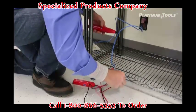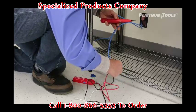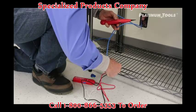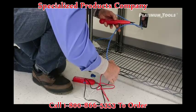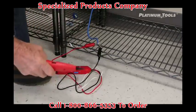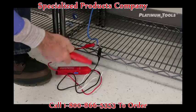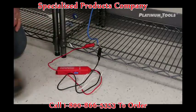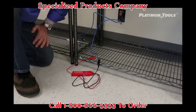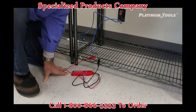Here's my cable that I really want to find out back in the server room — which cable is it — because no identification has been done. Before I start hooking everything up here at this location on the wall, I want to identify this cable, and then I'm going to turn my tone on. The light says it's generating tone, but let's turn the probe on and make sure it's definitely generating tone. Check it before I leave — now let's go for a walk and head for the server room to the back side of the building.